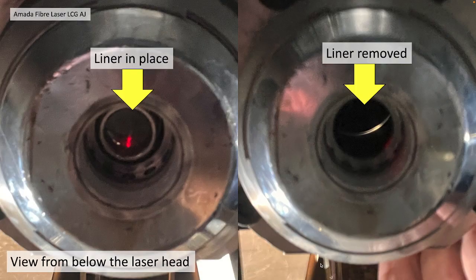The reason for this is: in the left-hand picture, you can see the nozzle liner in place; on the right-hand side, the nozzle liner removed. Once it's removed, you can get your finger in there and pull the remaining bits of the nozzle body out. That's the whole reason for moving the liner — with the liner in place, you can't get your finger behind the broken piece of the nozzle body.